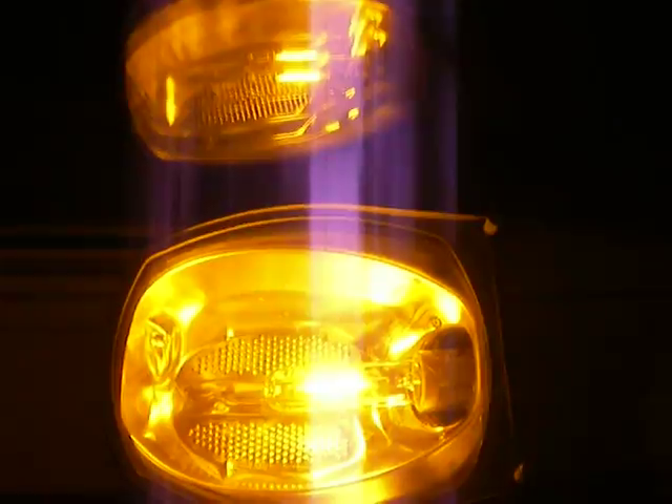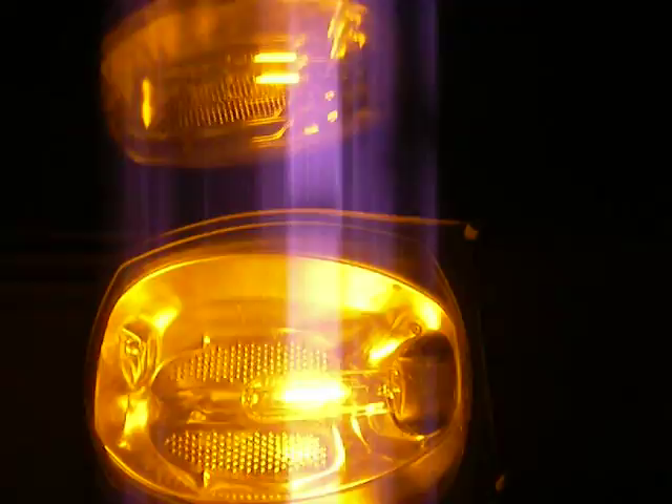The colour temperature of this lamp is about 2,000 to 2,200 kelvins. Kelvins relate to colour temperature — if you imagine a rainbow with its blend of colours, you've got the ultraviolet blue at the top end, green and yellow in the centre, then orange and red at the bottom. The higher the kelvins, the more blue the light is. This lamp sits at about 2,000 kelvins, which is quite low down, nearer to the red side of the spectrum.